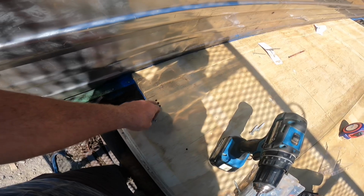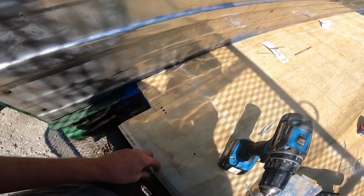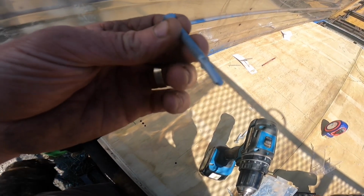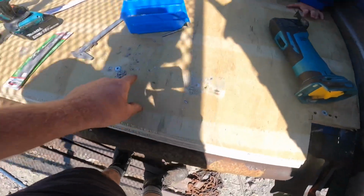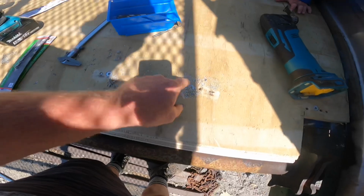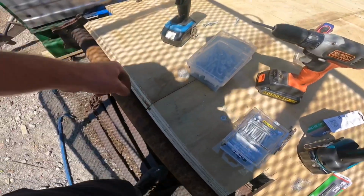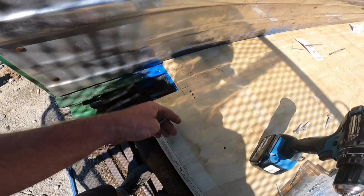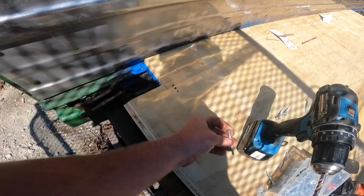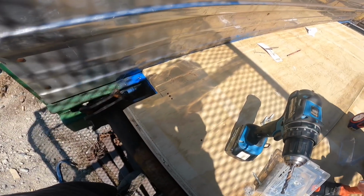But we'll see if we can drill through the steel, because they've got to go through, must be 3 or 4mm steel, so hopefully that piece there will drill through it. So we'll try it now. We've got several bugle screws over here that have snapped off, but then we've got some that have held when we've drilled the 6mm bit. And the other issue is that on the bottom of the steel is all the old screws sticking down, so if you get one of those when you're drilling the hole through, it throws off to the side. So we'll try this and see how it goes.